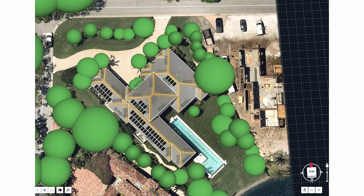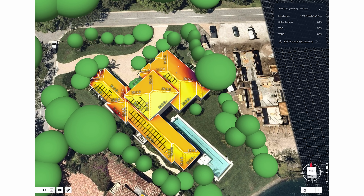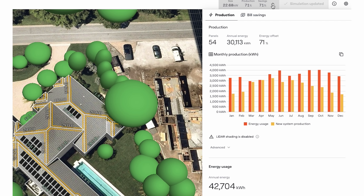We also have to consider a shading analysis of the property. Depending on where you live and how your terrain is laid out, there could be portions of your roof that receive shade during certain parts of the day — a nearby tree that casts a shadow on part of the roof. All of that's going to be factored into designing the correct size solar panel array. The key figure here is not your power rating in watts, but the total energy production over the entire annual cycle, and we want to match that up to your home's historical energy consumption.